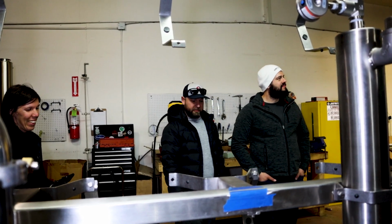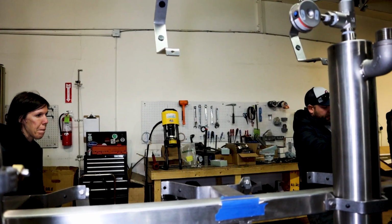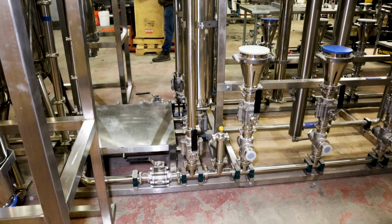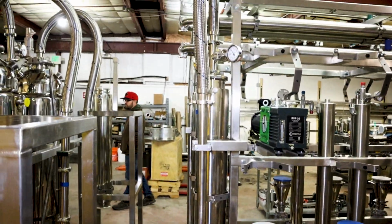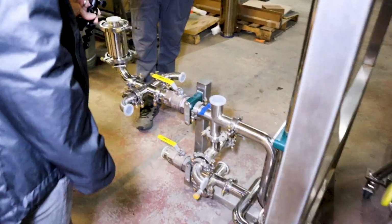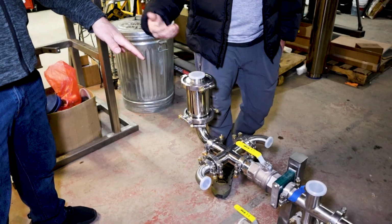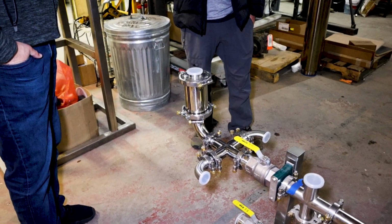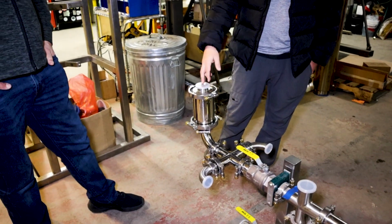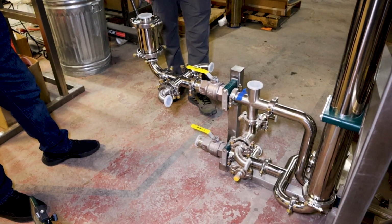That's our little H section, we call it. Very smart. That's just so you can bypass, so if you ever had a clog in your filter, you can still just keep going. This is filtration. We do a 0.22 micron metal filter here for anything coming off the pump, so if the pump were to break down, or if there was any metal. Oh, is this the cooling system? Both the compressors sit here. This is recovery. So this is actually process, but we'll make sure that nothing's coming off. This is all filtration to make sure that nothing from the compressor ever gets into the system.